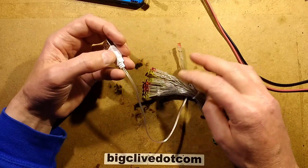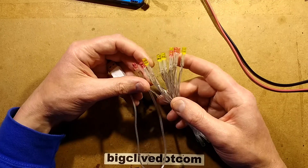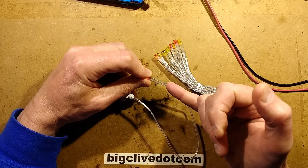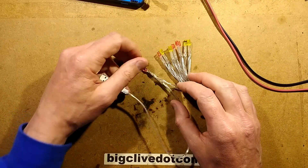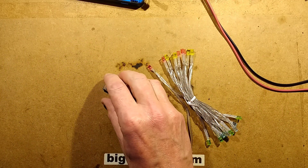I have to say I originally thought there's no resistor — I bet it just plugs in and it's super high current. And worse still, when it arrived I was looking at it and I was expecting a little resistor to be tucked into the first LED here before going out to the other connections, but there wasn't. I tested it and the current is low — it's 20 milliamps — but it still looks very nice.